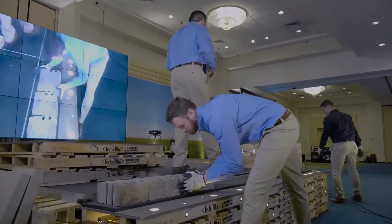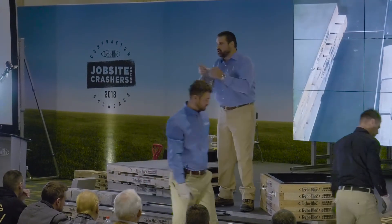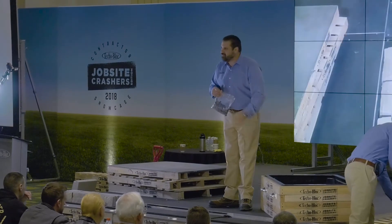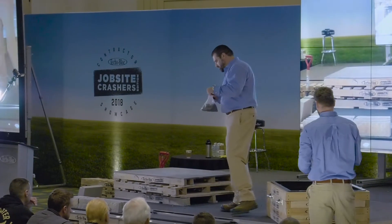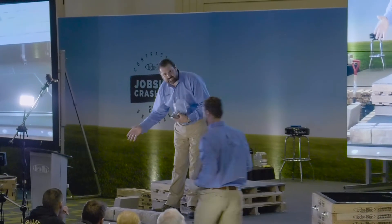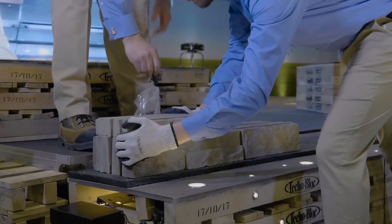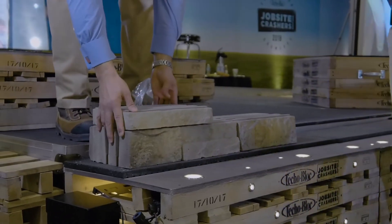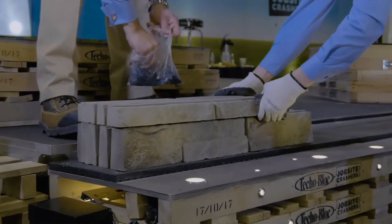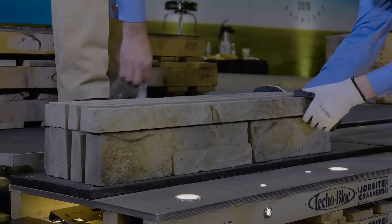Can I have some clips, please? The clips are packaged with the block in these little bags — you get way too many of them, I've been here 15 years and haven't figured that out, but you get plenty of them and they are free, packaged with the block. Now bring me the opposite C, B, A so we can complete this module of three. We're going to build vertical, so I'm using the back clip setting. I slide that clip in and make sure I get good positive engagement between the independent mechanical device and the previous unit.